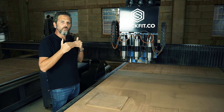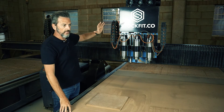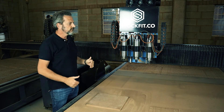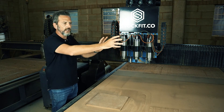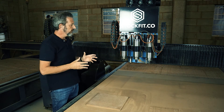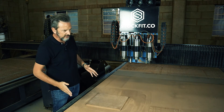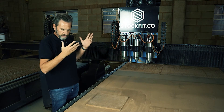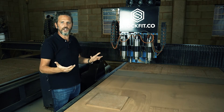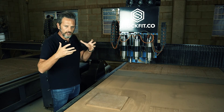The CNC machine will only stop once it hits its own limit switch. So if this machine was a half a mile long, the gantry would be able to move back as far as it allows — same for the X axis. If this was a four-meter wide bed, the gantry would move all the way that way. If I set up a file with limitations of, say, four meters by twelve meters, the machine will start its process and run. It'll run until it hits a limit switch and then say, sorry, we can't go any further, and you'll have an error on the file. The limit switches are what keeps you limited to whatever you can do.